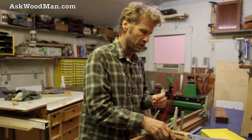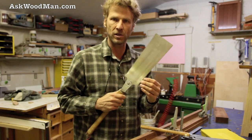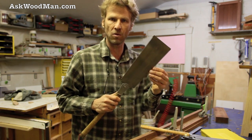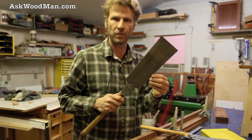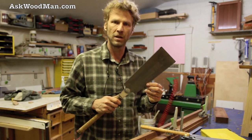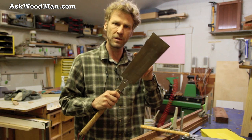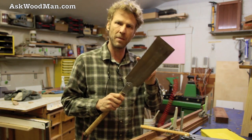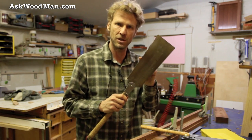This one is for when you need to get medieval on stuff and make an aggressive cross cut of a 2x4, or cut a board of hardwood at a rough length without having to get your skill saw or jigsaw out. It will just get right to it. This is the rip portion and it's very aggressive, but not many saws will cut straight into end grain as efficiently as this does.